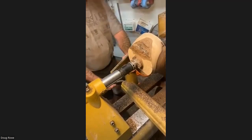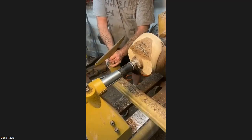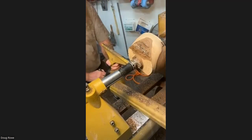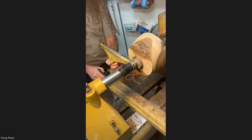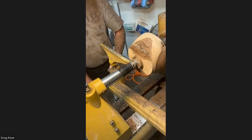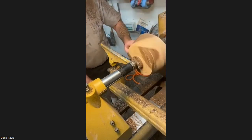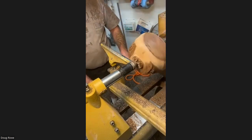Yeah, so the standard live centers are approximately 1 11/16, and your standard number 2 school pencil is approximately 1/4 of an inch. On that rotation, that adds a 1/2 inch. So it puts you just over 2 1/8 inch for a perfect tenon for your standard 2-inch jaws.